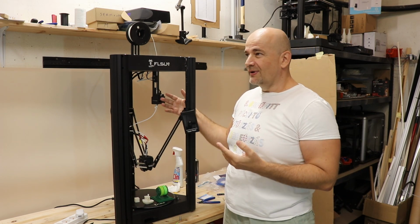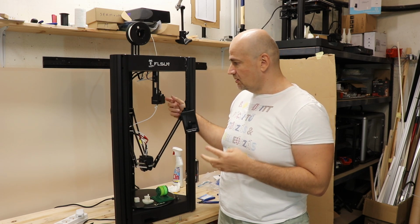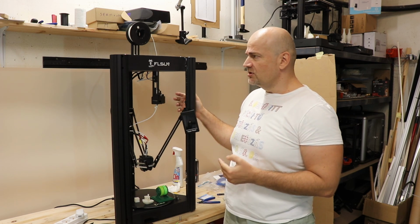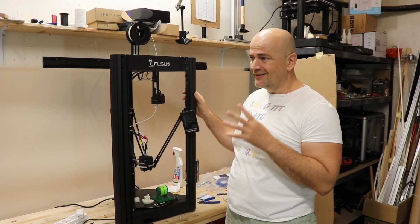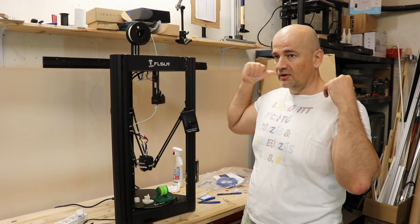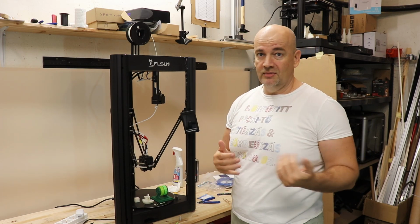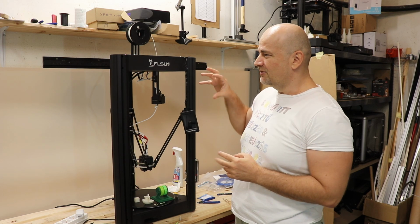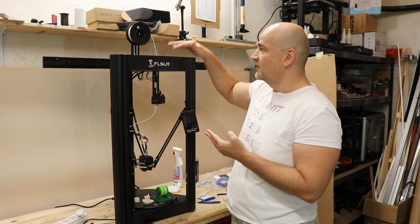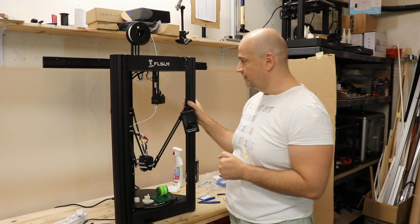And then next one is that noise from the retraction. During the extruding I cannot hear that noise, but of course that's slower, but during the retraction that's quite annoying, and that's the only reason why this printer will not be moved into my office, because I'm looking for a secondary printer which will be actually behind me 1 meter only, and that retraction is quite annoying. I'm not sure, is this a different stepper motor driver or it's too fast? I'm not sure at the moment.